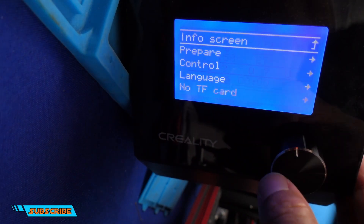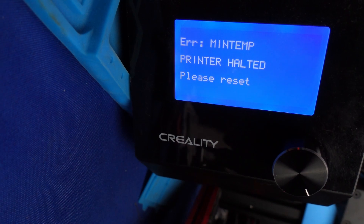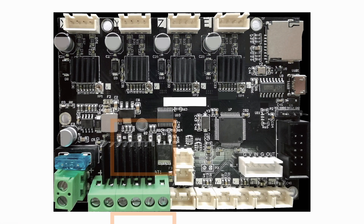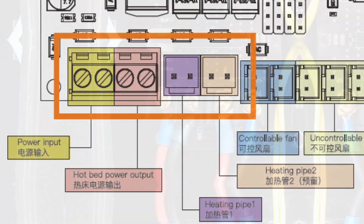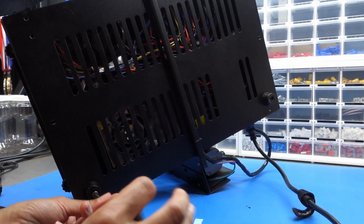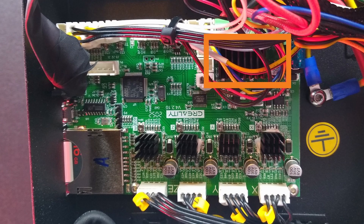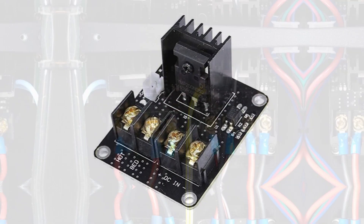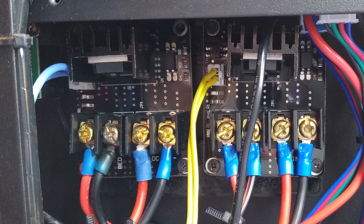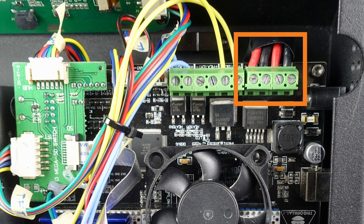As mentioned previously, I was using my own modified stock firmware which can be found on my website. All these FDM printers did have MOSFETs to help cool the motherboard, which is a very important feature. Since most of the power is being drawn to the hotend and the build plate, having those will help cool the connections and keep them from burning out. On my i3 Mega and Mega S these were not present and I had to add them in separately. The Creality machines all have these built into the motherboards, and so long as they have been properly installed they will help cool the motherboard and prevent the wires from overheating. On my Anycubic, although the connections did overheat, the damage was contained to the MOSFET — caused because of the tinned wires that were still present at the time.